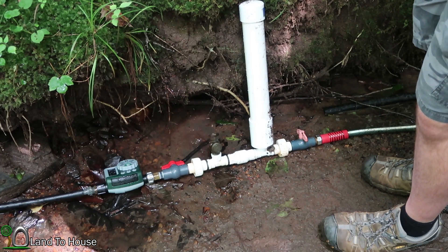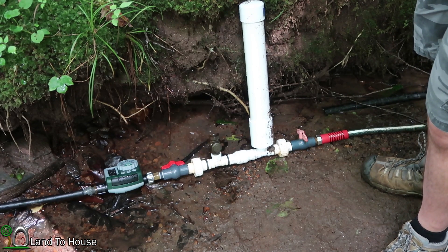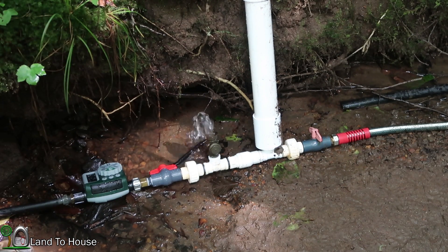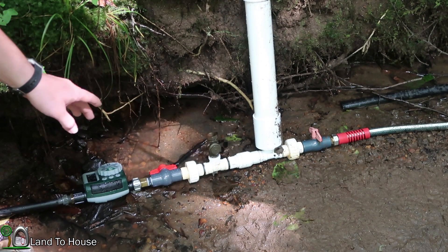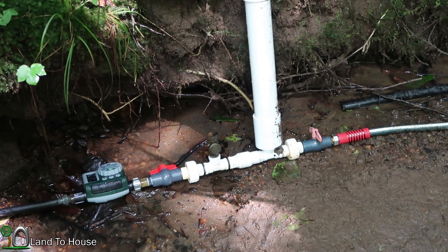The valve is open — it is possible to auto start and stop a ram pump. This time I want the timer to turn off the pump. I'm going to give it about a minute sitting without any use and see if it will start back. There we go — so in one minute I'm going to start this back and see if it will still work.